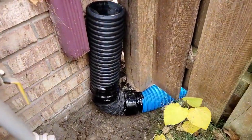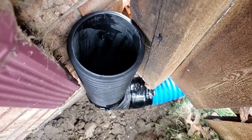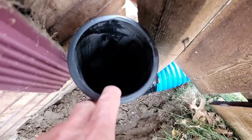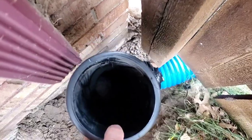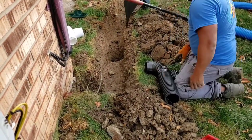The dual wall pipe riser is smooth on the inside — it's like a Teflon pan. We want to keep up the velocity of the water. The fluid dynamics of this vented clean-out are second to none, and we want to build our system to accommodate and complement it.